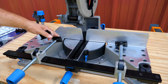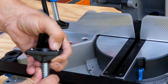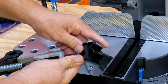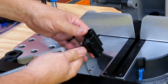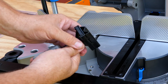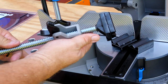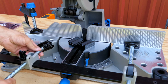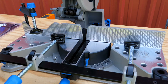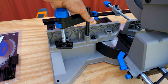In addition to the flat feet for clamping, we can take these and easily slide them on — you see the detents right there, so it holds them on. Now if we're cutting some type of angle iron or even a square turned up at an angle, we can use these for holding them down, or even round tubing. We get three of these so we can put them on all three of the clamps.